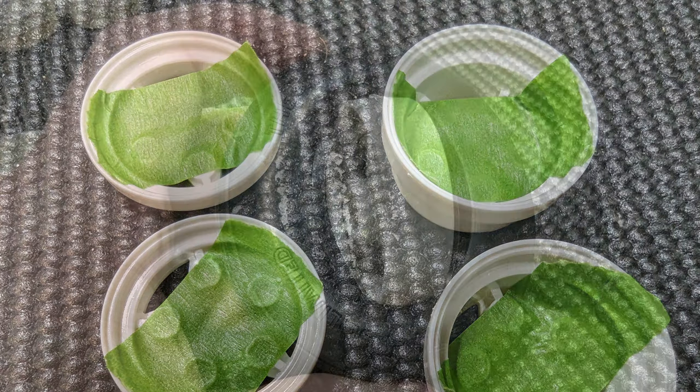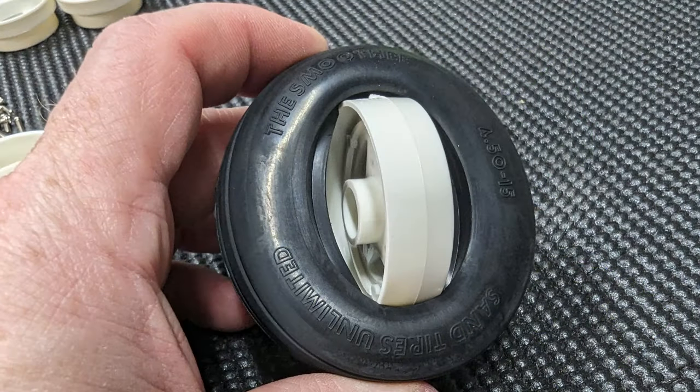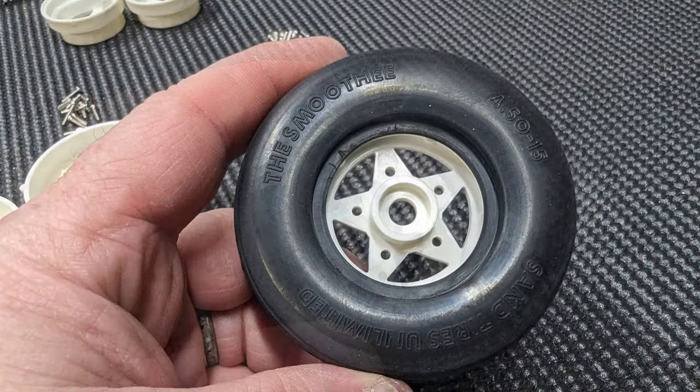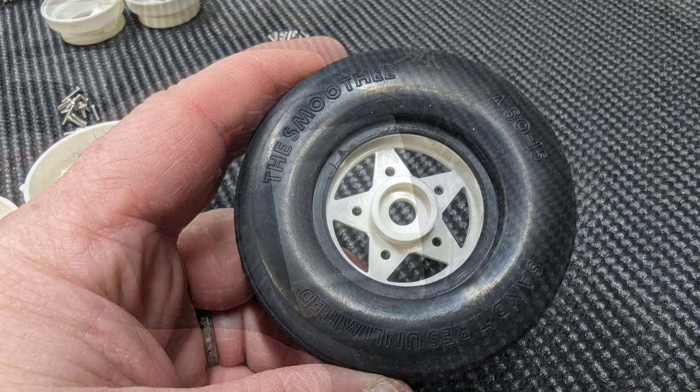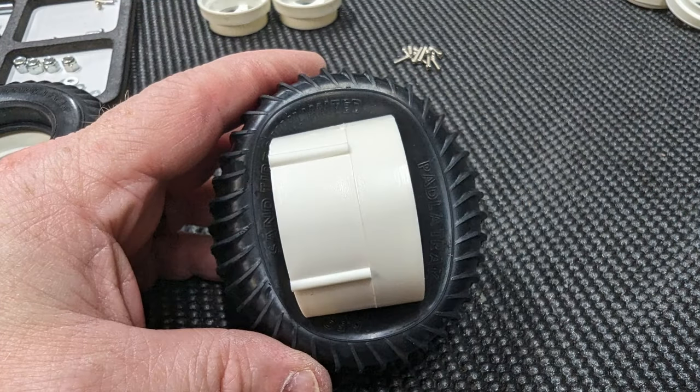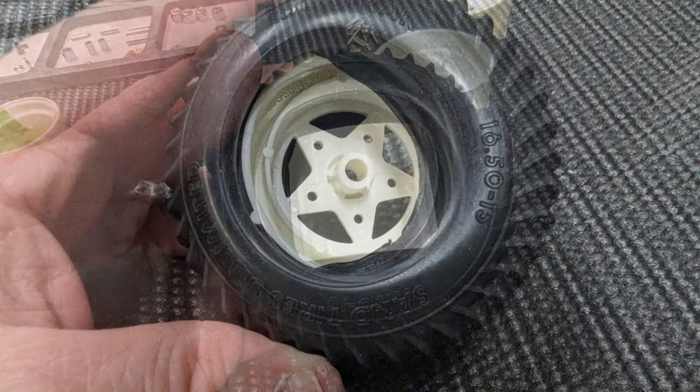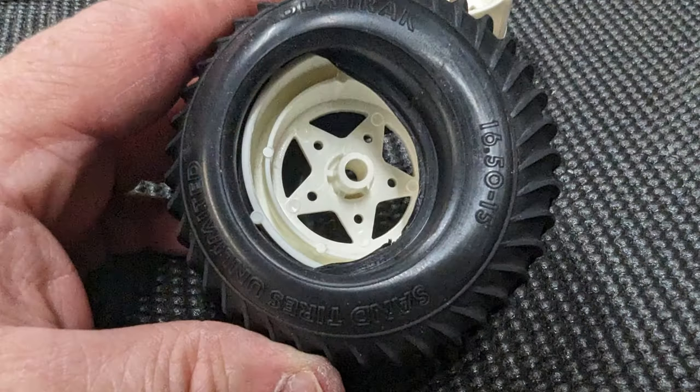Now this is where it gets troublesome. The front one, you just want to stick it straight through the tire, right down the middle, rotate it, and then get the bead set in there. The front tire is much easier than the rear tire is. The rear tire is going to be the one that gives you trouble. As you can see here, the rear, you really have to stretch that tire, but just work one side of it into the other, and then once it pops in, you're golden. All you have to do is rotate that around. You'll get your bead set into that groove in the wheel.